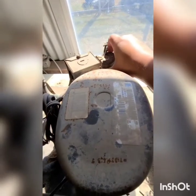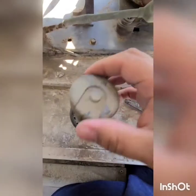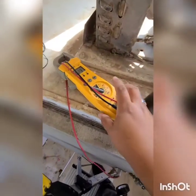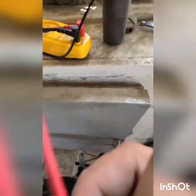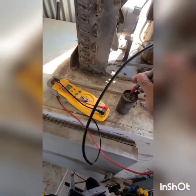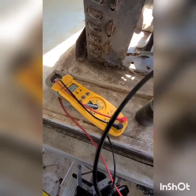The condenser fan was running but the compressor is not running at all — didn't even try to start up, no amps or anything. So I've popped out this capacitor and I'm going to check the starting component. This sits into this clip just like that and you pop it open with a flat head screwdriver. Then you pop open this cap with the flat head and put your meter on microfarads. Sometimes these read above 200 so you'll get an open line.